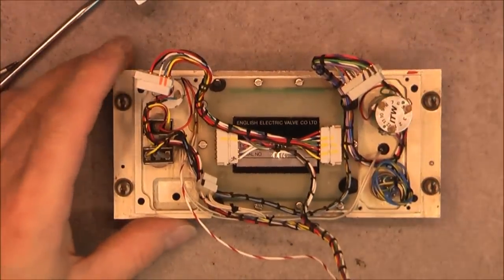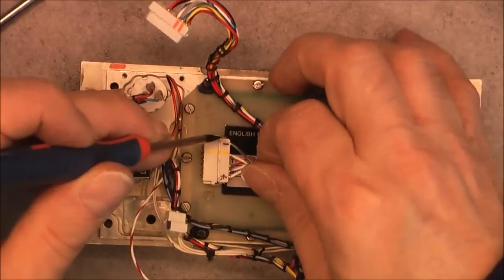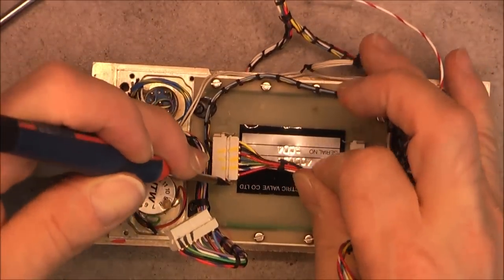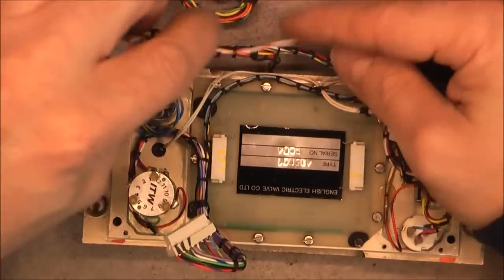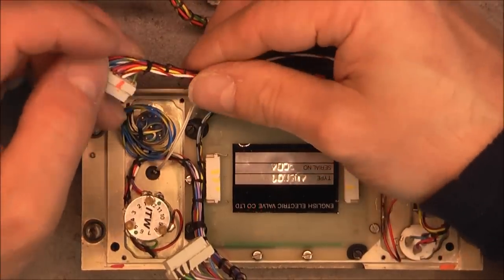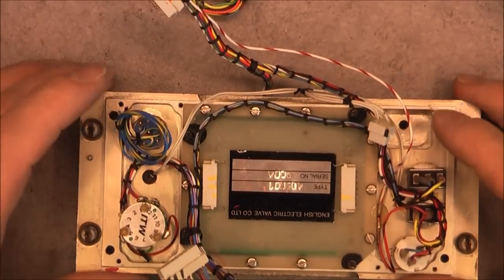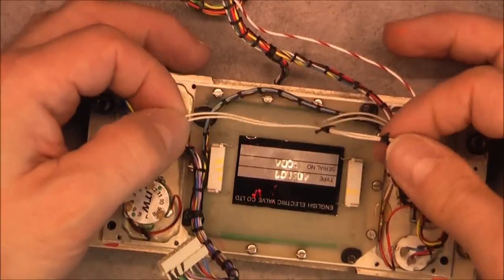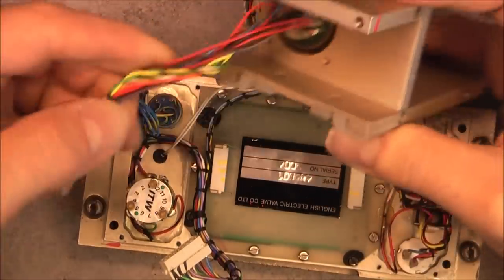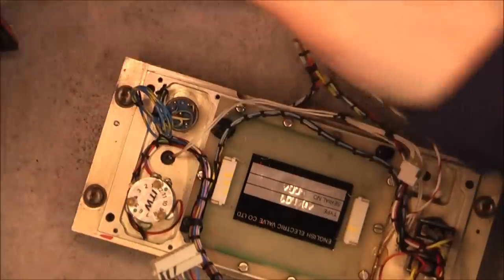So we have obviously a number of screws all around. For my own convenience, I will undo the 2 connectors here. What I will probably do before reassembly is to secure a little bit better this loose wire here. It is quite weird they did not include it in the wiring loom. Anyway, I will do cable lacing here, and it will be a little bit better. Also maybe here, you can see, and here. Really, not the best work. And here also, they could have done it further in the thing. I will maybe undo completely the connector and finish the work because it is not done completely.